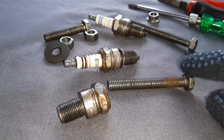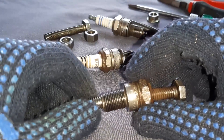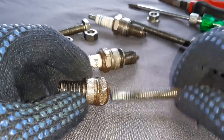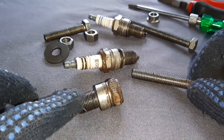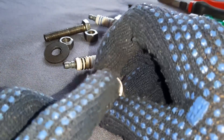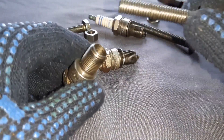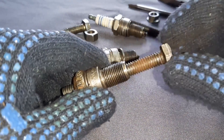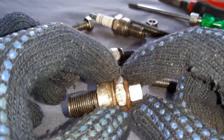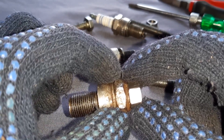If you place the bolt in this, it won't go straight. Normally this size bolt will not go into this. For that, you have to make the hole which is equal to this. There should not be much slack — it must fit almost accurately. You can place the nut here and you can go ahead with welding.